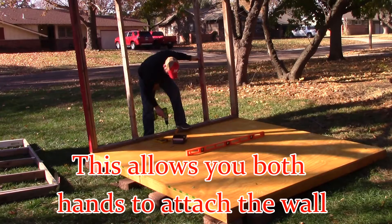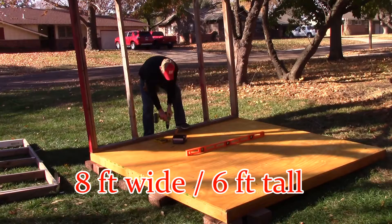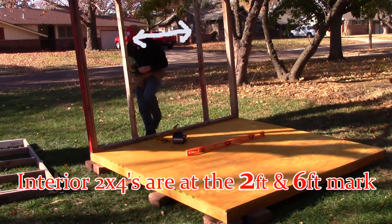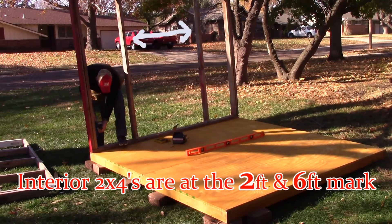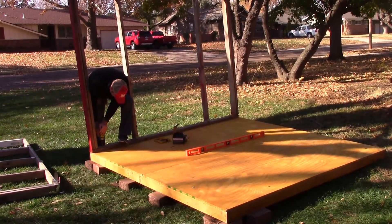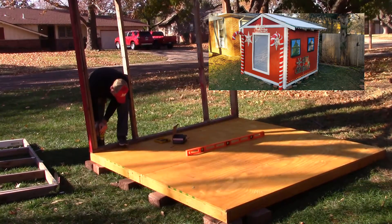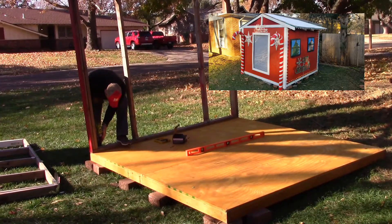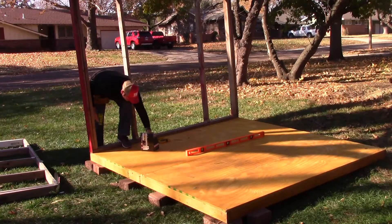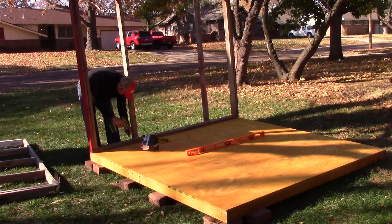The wall here is eight feet wide and six feet tall, and the two inner two-by-fours are attached at the two-foot mark. The reason this wall is the only one of the four that has a gap in the center is that's where our holographic Santa Claus goes — that's where our plexiglass screen is attached. It gives us the widest view for our street audience to see Santa Claus. This is 100% screws — not a single nail anywhere other than the floorboard.